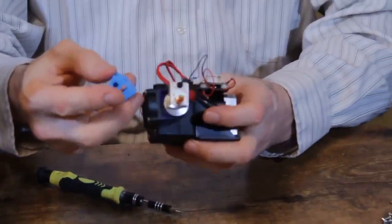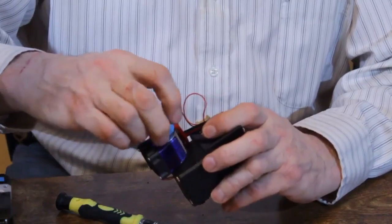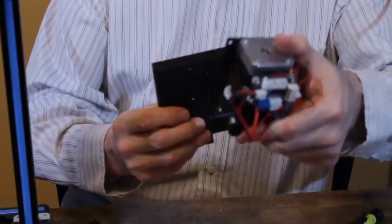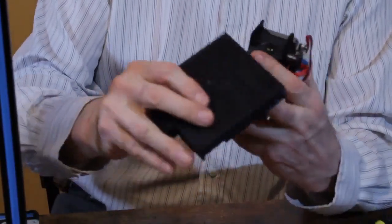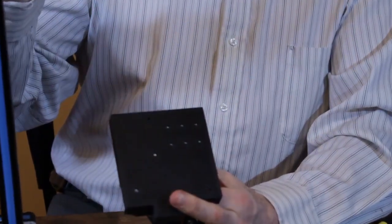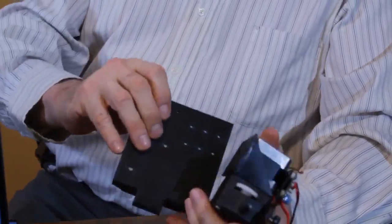Okay, you can take the silicone sock that came with the other hot end. And that other hot end, the nozzle and the heat block are the same. So you have a spare one. So now we're going to take this plate, mount it on the printer, and we're going to mount the extruder onto the plate. The extruder's mounting bracket has 3 holes on the top, 3 holes on the bottom. The 3 top ones are going to go into these 3 bottom holes here, and then the bottom hole is going to go into here. The reason I have 6 is because that's what I was able to align with the metal plate, and I wanted to give maximum flexibility to mounting other extruders. So let's go to the machine.